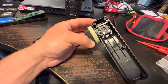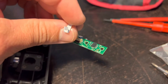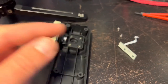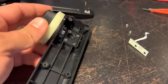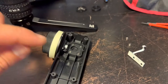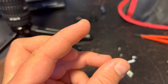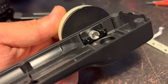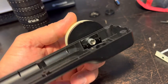So here's me attempting to do this to this wheel — if I do that, this gimbal is going to be way better. That's the board. Previous mechanisms used a potentiometer with fine contacts giving impulses, or like CDJ jog wheels that use a transparent wheel with tiny markings passing through a U-shaped device with a photodiode on one side and an infrared LED on the other, registering each step. But this one uses a magnetic field — it's wicked. There are no steps; it's all analog.